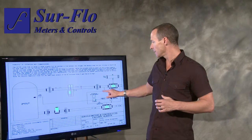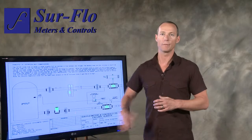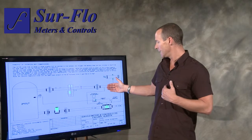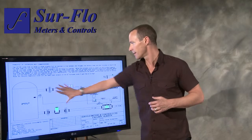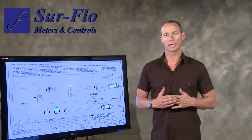As you can see, we take a little slip line here and run it from the gas leg. We don't use water because we find that the valve reacts much quicker with gas than it does with water or liquids. So the idea is that this is locked up. All that gas is allowed to come in here, and because this is all the same pressure on this side of it, these pressures are equalized again and the valve is locked up.